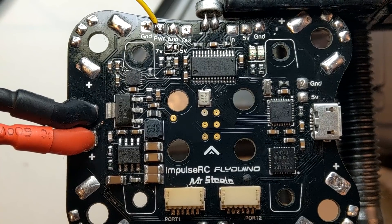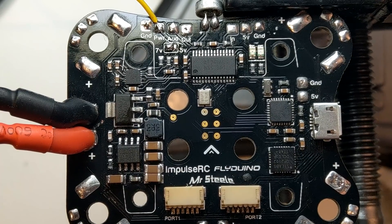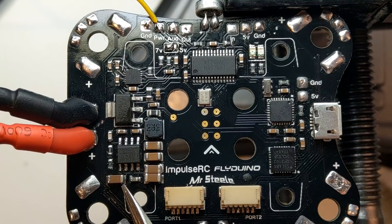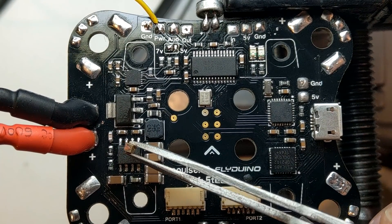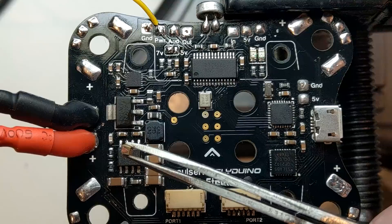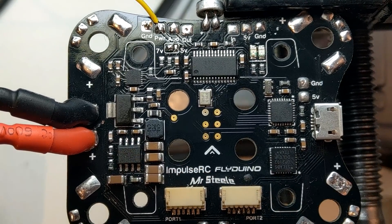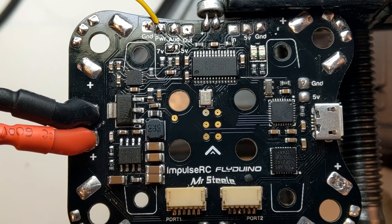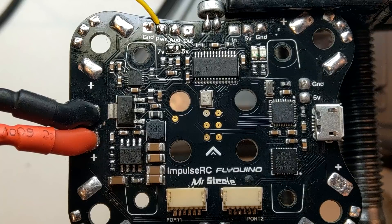Remember: if you have water damage on your parts, clean them and inspect every corrosion happening on the PCB. Don't get fooled by parts that appear to be looking okay because the solder gets eaten away by corrosion, and also the parts themselves. If you look here, you can see that the copper deposits on the part got eaten away and only a small amount remained, and that makes this part not working as expected. So first thing you need to do when you recover your electronics: inspect corrosion everywhere. Thank you very much for watching, I hope this was helpful, and see you next time. Bye.